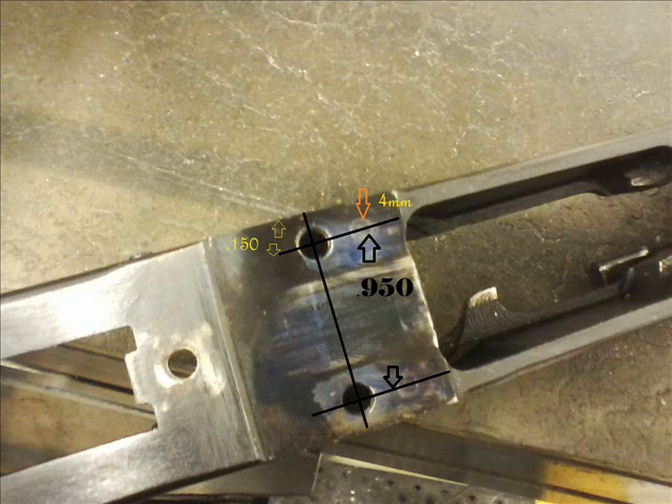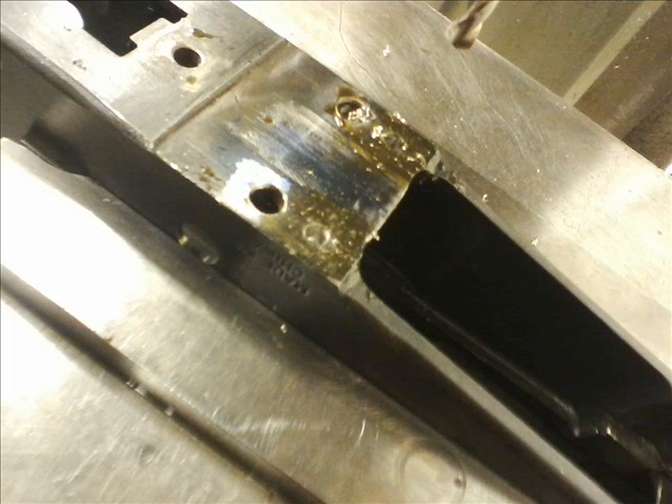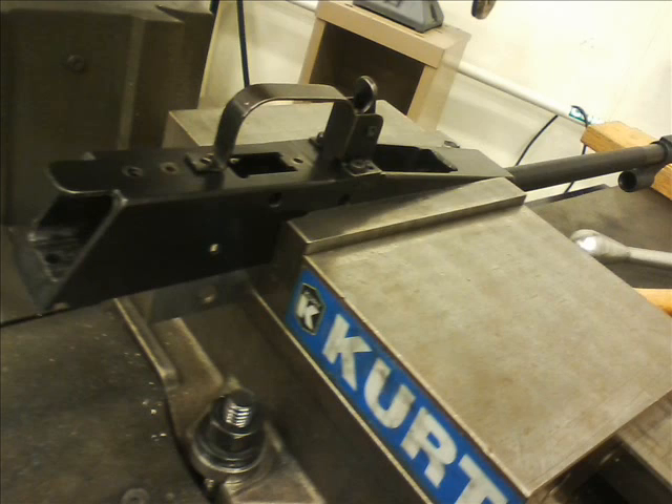This is rather straightforward. The metal isn't too hard, so just center drill it and then drill your holes at four millimeter — that's what I'm doing right here, with a little Moly-D, good stuff. I'm testing the magazine release from the trigger guard onto the rifle. Use the rear trigger guard hole to scribe your hole to drill. The hole immediately behind it is for a pistol grip — open it up to six millimeters.